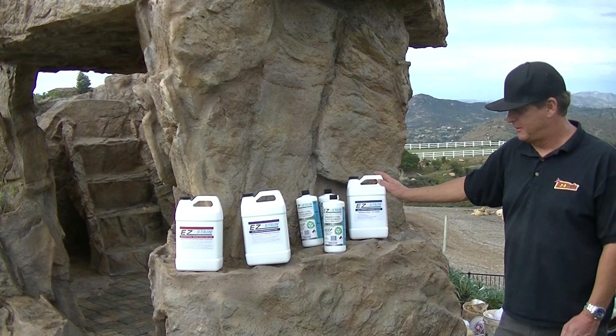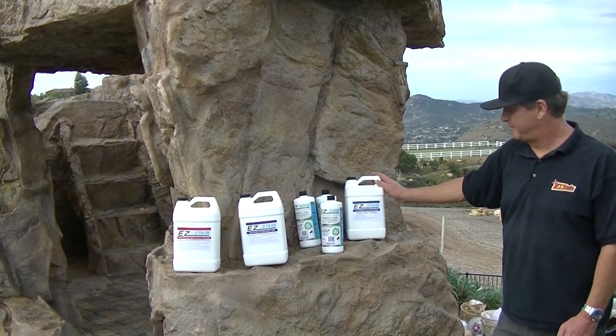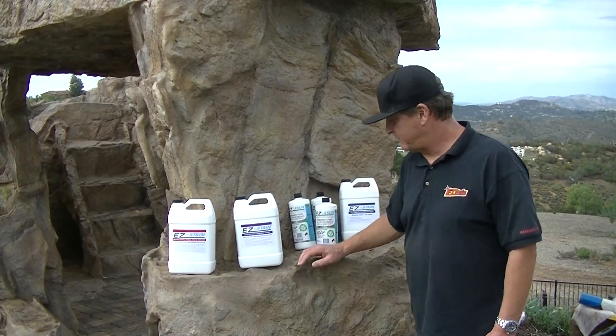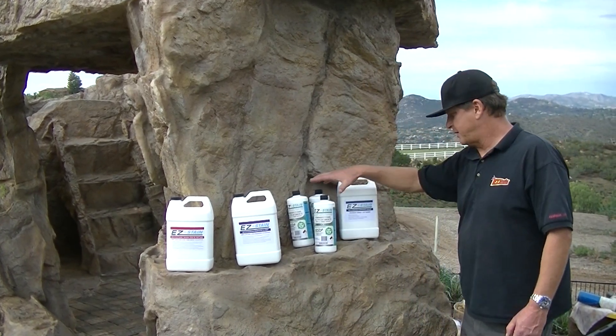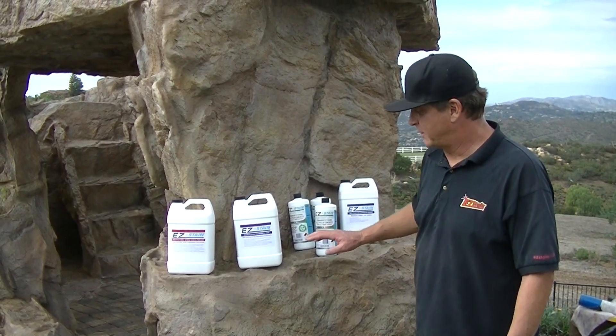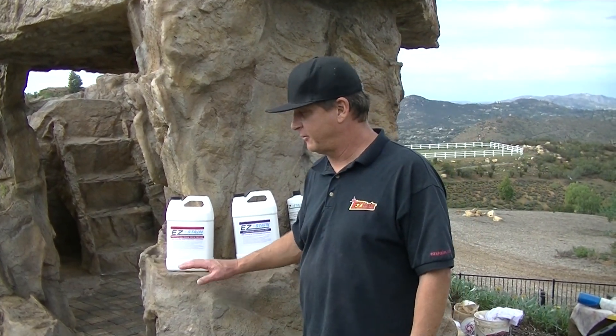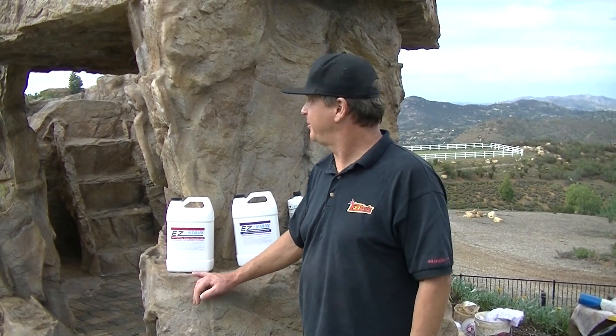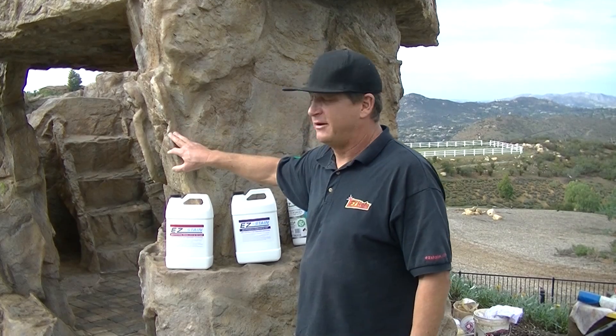This morning it wasn't raining, and they finished the first coat and it started raining. The good news is that all these products — the sealer and stain products — all have high resistance to early wetting. So all this stuff was wet, and some of it even clouded and turned white a little bit from the water. But the sun came out, it dried, and they were able to put a second finish coat on. So this job's all done.